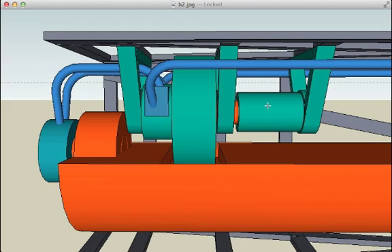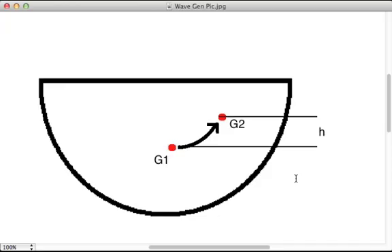Let's have a quick look at the calculation we need to do to find out how much power this machine can create. This picture here is a cross-section of the semi-cylinder. As the ship rolls, it would look like the cylinder was moving. To calculate roughly how much energy we could create, we need to calculate the potential energy — specifically when the centre of gravity of the cylinder moves from G1 to G2. To do that, we calculate the height, and then how heavy the cylinder is, which gives us the potential energy from this device.